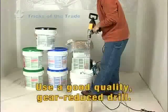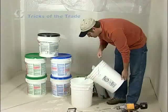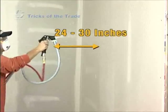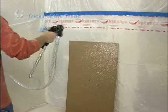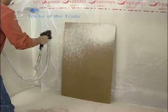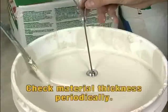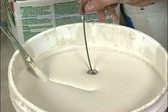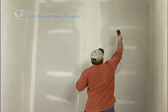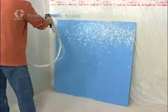Use a good quality gear-reduced drill to mix your texture materials — smaller, single speed drills can't handle the heavy loads created when mixing texture materials. When mixing dry powder materials, always add the water to your mixing bucket first, then add the dry mix to the water. Always start with the spray gun 24 to 30 inches from the work surface and move in closer if necessary. If you start too close, there is no way to fix an excess buildup of texture without scraping the surface and starting over. For continuous spraying, use the trigger lock to hold the trigger open and reduce fatigue. Check your material thickness periodically and agitate and thin the material as needed. To prevent material surge, point the gun off the work surface onto a drop cloth or protective film before moving onto the work surface.